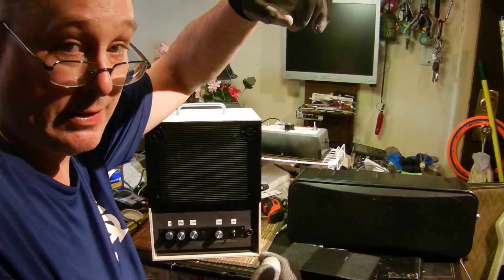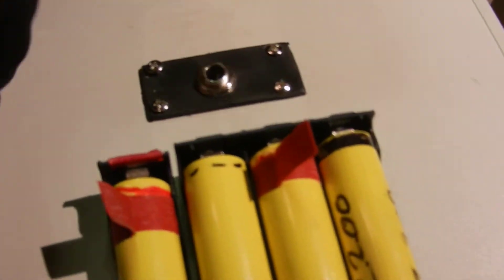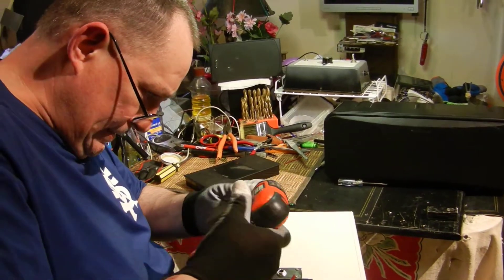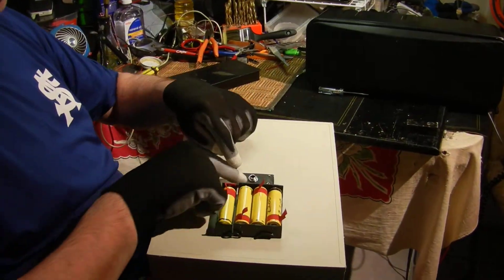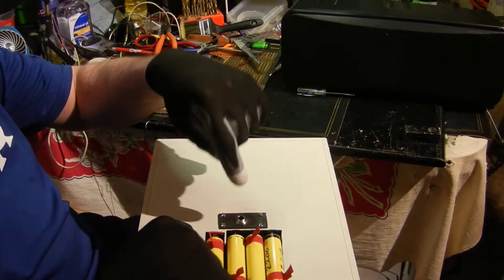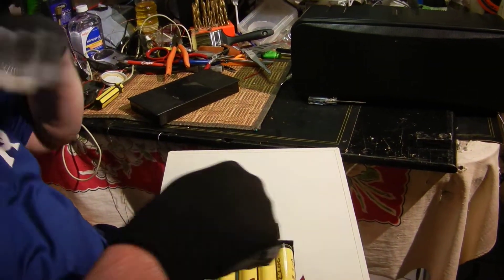Electronics are made like you're mounting through sheet metal, so you have to cut a larger hole for the thing to sit flush. This is part of the VHS tab — I cut it and put four screws through it. They look a bit bulky. Basically you drill out four holes, use a countersink to chamfer them, drill the center hole — best to mark it first so it's centered, I didn't do that so it's off — then mount your jack to the plate and drop it into the unit once the hole is big enough.